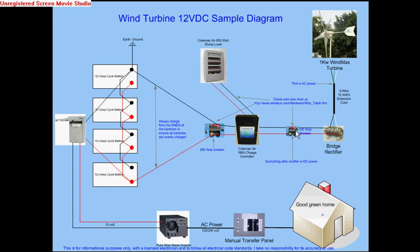You can check all of the wire sizes that need to go from the bridge rectifier through the charge controller, out to the dump load, to the batteries, to the DC disconnect, and to the inverter. There are several places on the internet where you can find DC wire charts and calculators that will show you what size wire you need for a given length, amperage load, and circuit voltage.